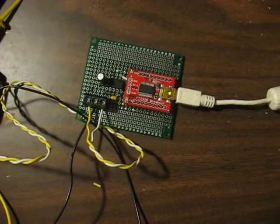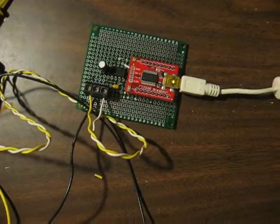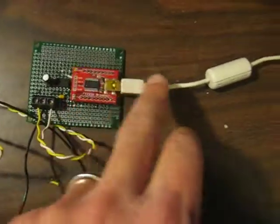It mimics the electrical connection of a regular breadboard for the most part. But anyway, this is connecting the RS-485 bus up to the USB, which leads me over to my server, which is running seismic right now, but there's the server program that's talking out over that USB bus. And what you see it doing is issuing ID checks, one after the other. And there's a few timeouts running around in there because my computer room happens to be fairly noisy.